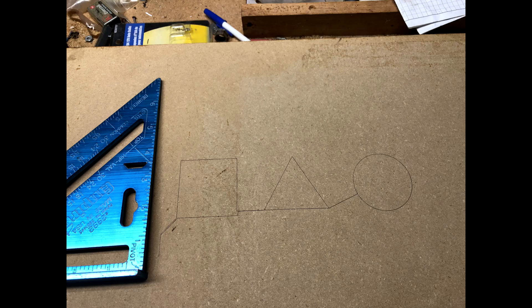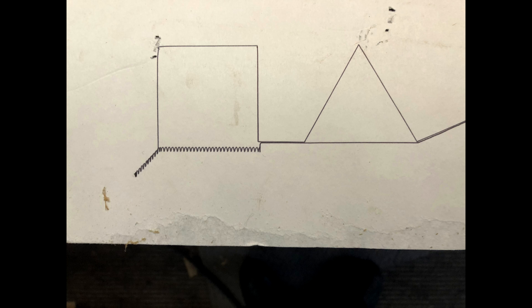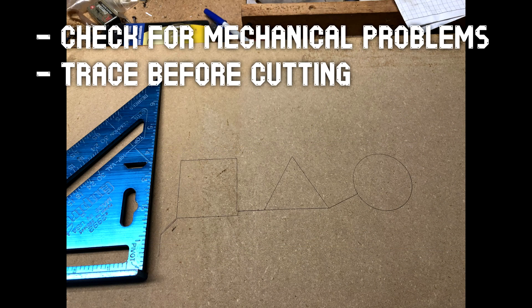That's how the drawing turned out — the circle looks pretty good, the bottom of the square is a little messed up, I think that was probably from the pen moving. I also had some oscillation on the y-axis and had to turn down the gain in the PID algorithm in K-Motion. Our lessons learned: always check your mechanical linkage because that's probably where your problem is, and if possible try to rig up some sort of tracing system so that you can check the path without actually having to cut through expensive material.